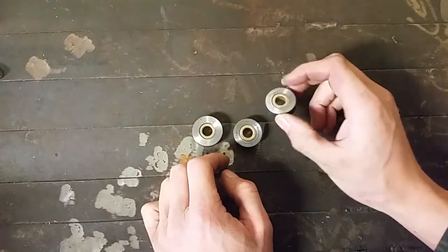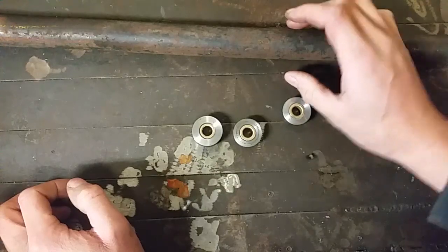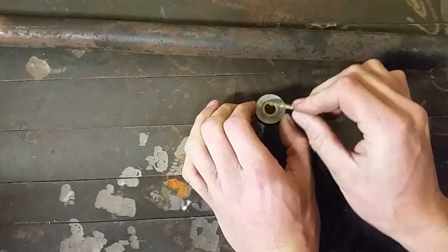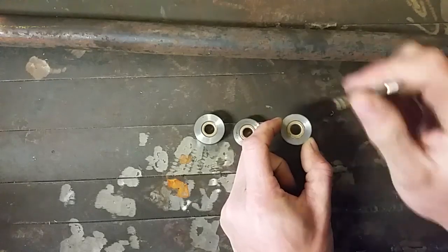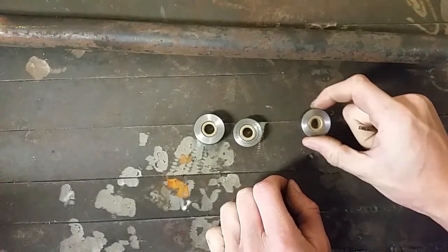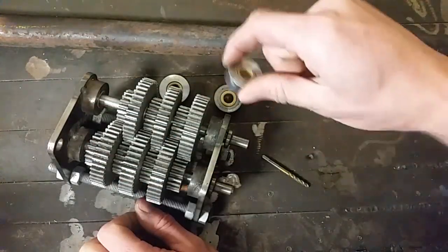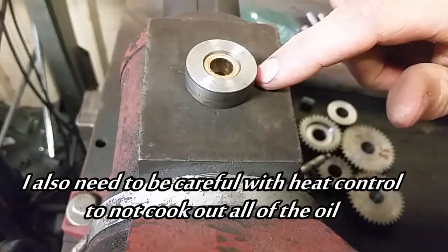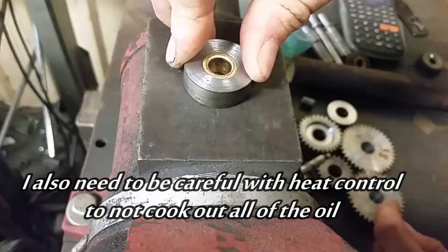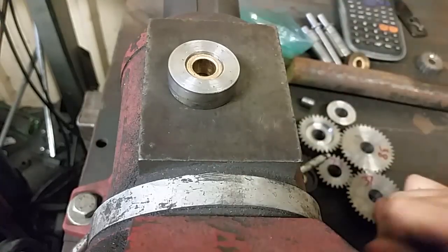I've gone with bronze bushes everywhere. The main reason is just the stock I had on hand — a reasonable amount of 30mm round bar from a scrap yard, which was a fairly convenient size to press bearings into. These were originally going to have four oversized holes so the body could have M4 tapped holes and I could fine-adjust to get correct mesh. I experimented and found just tacking them was good enough. The bearings warp as the weld shrinks, so I tack one side, put it in the vise, pull the bearing down, then tack the other side. That's been working really well to get correct alignment.